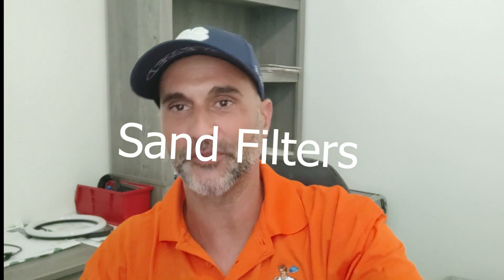The other big problem — and I'm not sure if this is a massive issue since I've only had a couple of sand filters and they're not very popular where I am in Central Florida — but if you have a broken lateral, you're going to get a mess in your pool. You've got to get the sand back out of the pool, take the top off, vacuum all the sand out, and take the lateral out. If you're not handy, that's a service call for a pool company to go out there, replace the laterals, replace the sand. If that does happen, that can definitely be a pain.